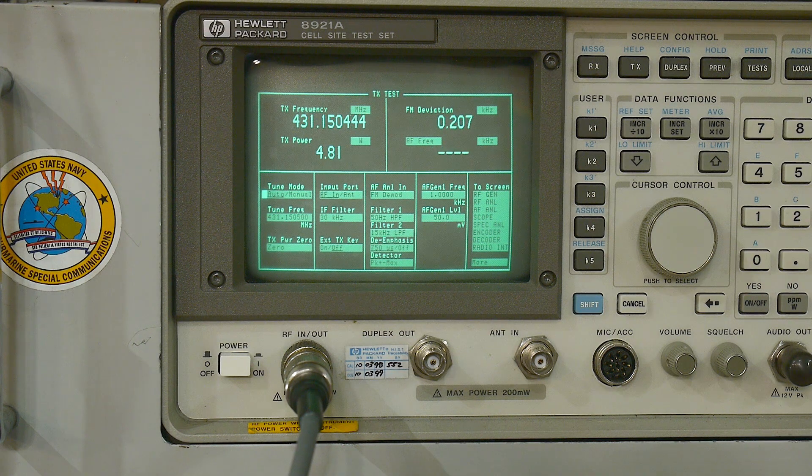We'll transmit at low power: 4.8 watts. Let me go to function power. Okay, here's medium: 13.8 watts. And let's go to high power: 22.1 watts — looking good. We're drawing about 10 amps. Very nice. Let's try it on 440. I changed it to 445.15 MHz. Low power is 4.4 watts, mid power 15.2 watts, and high power is 24.6 watts. So very, very good. Passes the power test.